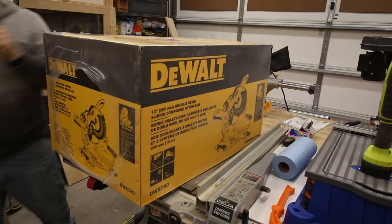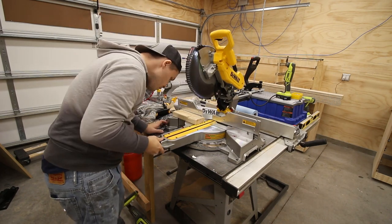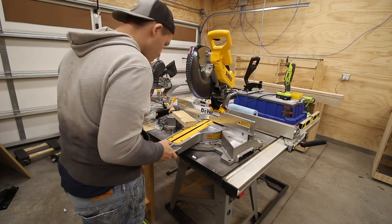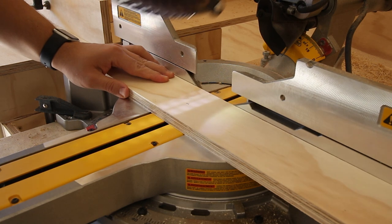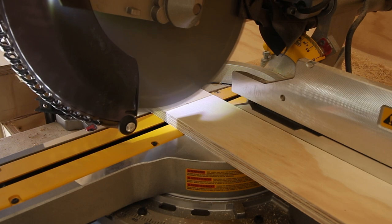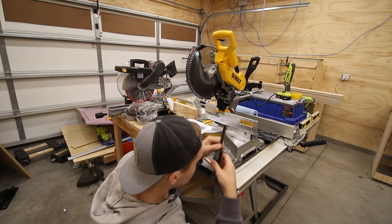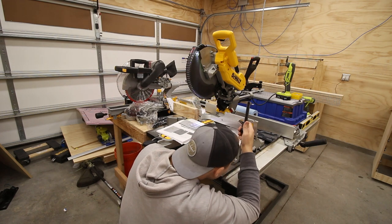I'm not a purist on any particular brand of tools — I have a lot of Ryobi battery power tools, but obviously that doesn't really matter for an AC powered miter saw. In this case, I opted for a Dewalt model with their XPS system. Rather than a laser system shining a line down on the workpiece that potentially needs tuning, this system has a light directly above the blade that causes the blade itself to cast a shadow line onto the workpiece. That means that the line will always accurately reflect the blade that's installed — a thin kerf blade, for example, will show a narrower line.